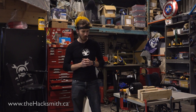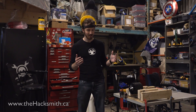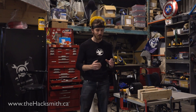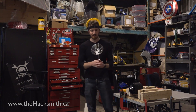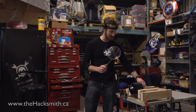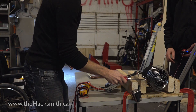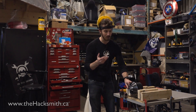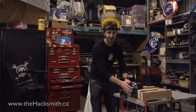Those results are actually quite promising — the EDF didn't seem to take any damage even when we shot it with an airsoft gun. But I still don't like the idea of accidentally getting my finger stuck in there or clothing getting sucked in. So we're going to see if we can put some kind of mesh to protect the EDF. What we're actually using is a strainer on our thrust test jig. We'll test the max thrust without it and then test again with it in place — there's a chance it will result in a drop in thrust, hopefully marginal.